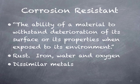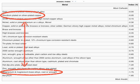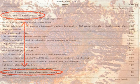That's handled by the use of galvanized steel or materials that will not rust, like non-iron materials. The more common one we have to deal with is the deterioration that occurs when dissimilar metals contact each other — they pass their electrons from one to the other when water passes across them, which weakens the metals. If we look at this chart, this is an anodic index of various metals — a chemical chart related to the chemical reaction of various materials together. At the top we have the most cathodic metals, and at the bottom the most anodic metals. The further apart metals are on this chart, the more dissimilar they are, and the more readily electrons pass between them and deterioration will occur.